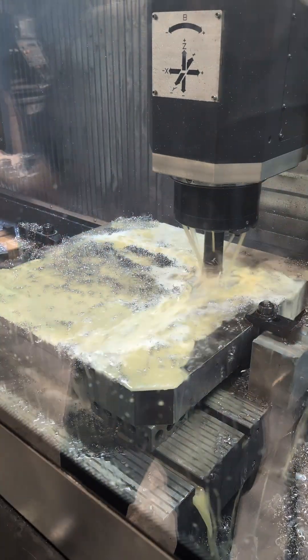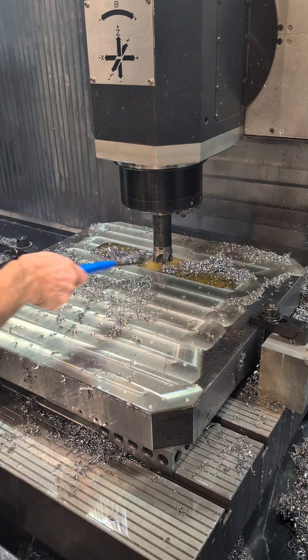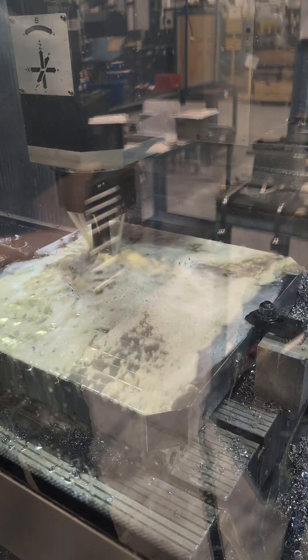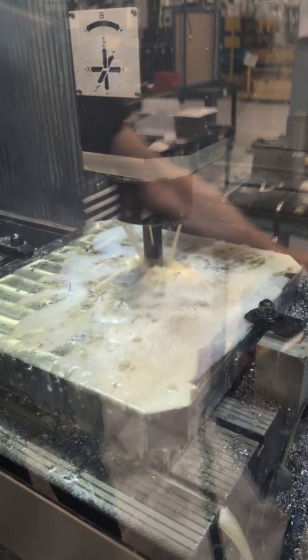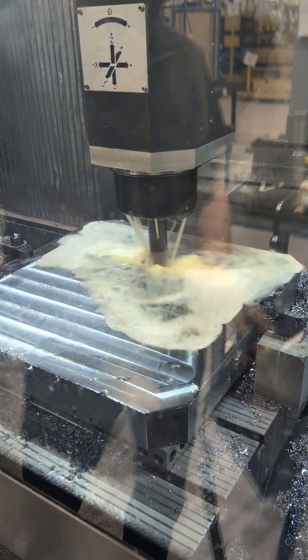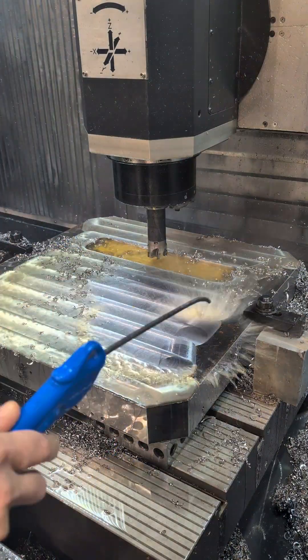So I've got to keep picking it up. When it gets a little deeper, I'm cleaning it out every second lap — two laps and I clean it out — and it's only taking half a millimeter per lap. So every single millimeter of steel, I've got to stop it, clean it all out, blow it out, and start it again, standing there.